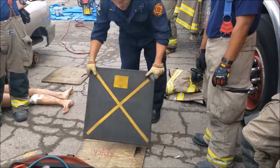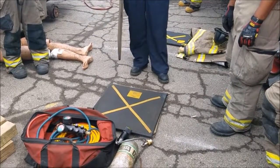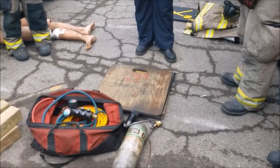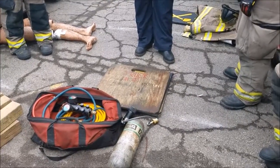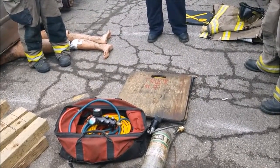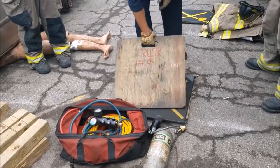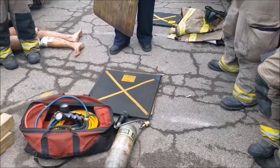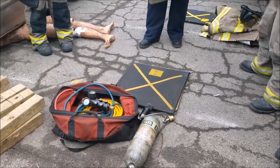Whenever possible, we want to protect the bottom side of the bag — that's why we have this wood. But as a rule, you generally do not want to put anything hard on top of your airbags. I know that goes against what a lot of us were taught, but there are at least two case studies — one in Pennsylvania and one in Toronto — where a piece of wood kicked out while inflating the bags, hit a guy in the neck who was kneeling nearby monitoring the lift, and killed him. Since that can pop out, don't put anything hard over the top of the bags.